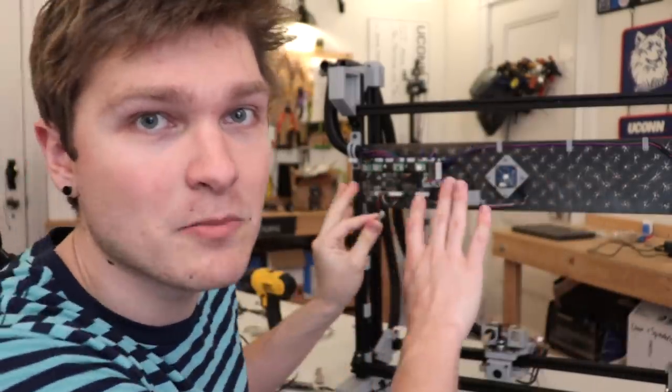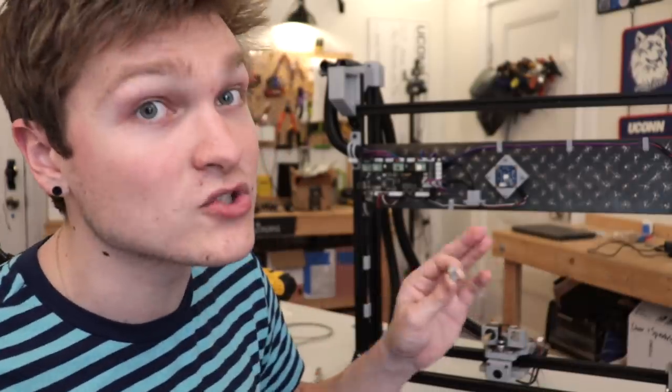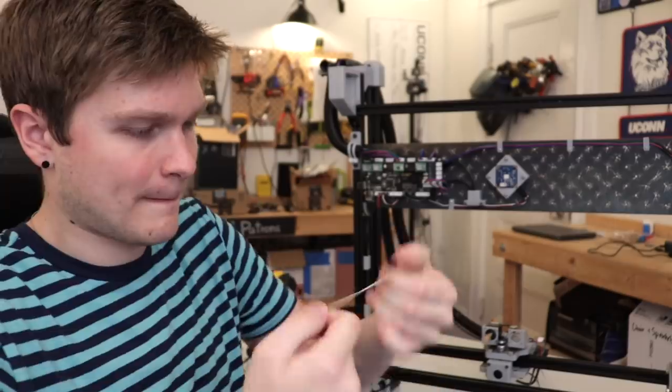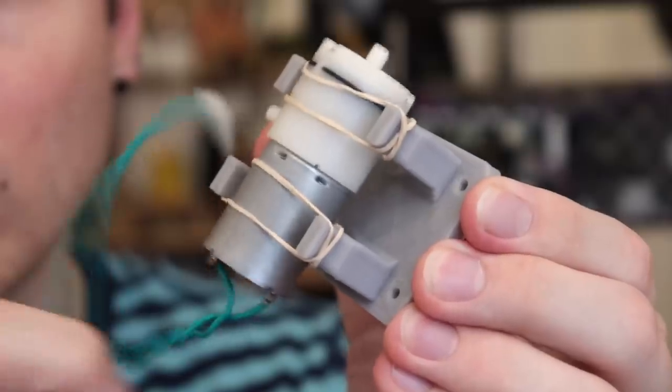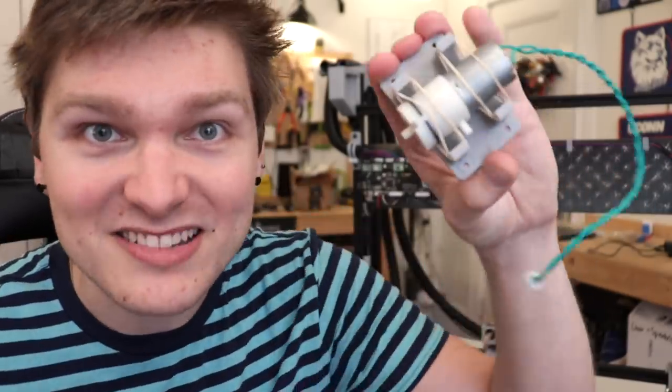It's so nice and neat and organized. I designed these little parts used to grip a cable down onto the peak array, and being able to decide where a cable goes helps organize everything so much. I also designed a little clip that holds cables inside and right outside of the aluminum extrusion — those are really only necessary for the Y-motors and their long cables that travel the whole way back, but they keep everything so neat. The last part to add is the pump mount. I know it looks pretty weird, but with a couple of rubber bands it has a shock mount to it. So even when it's running like crazy and shaking around, it's not going to physically shake a rigid part attached to the machine, so it shouldn't shake the camera at all.